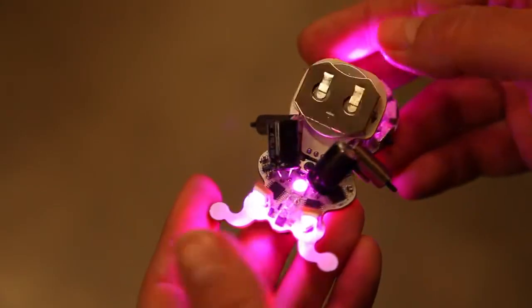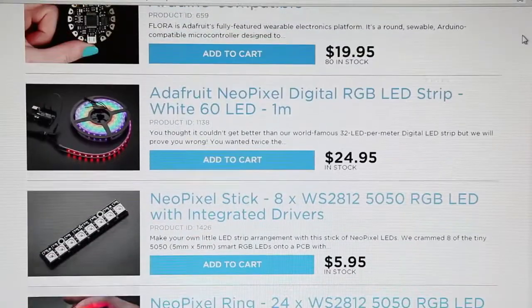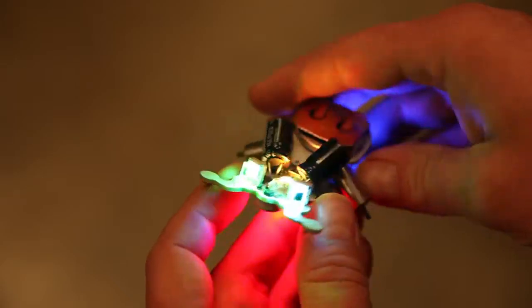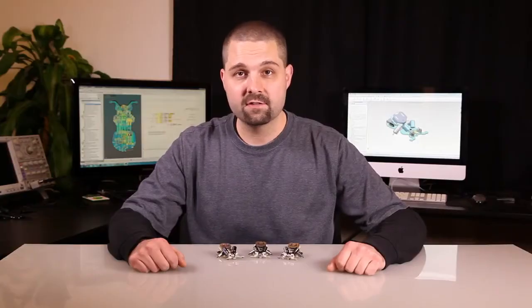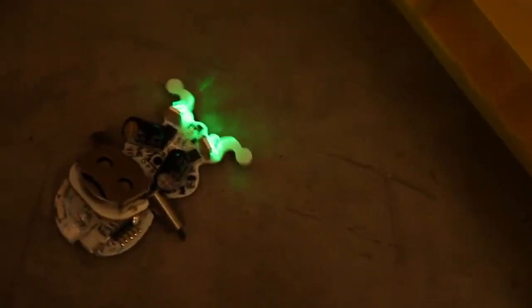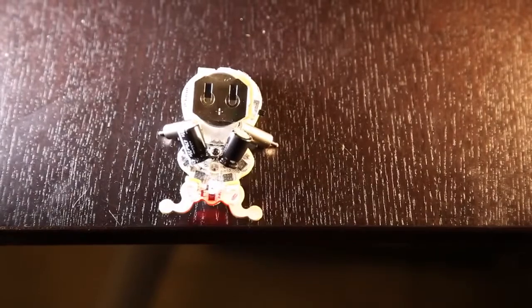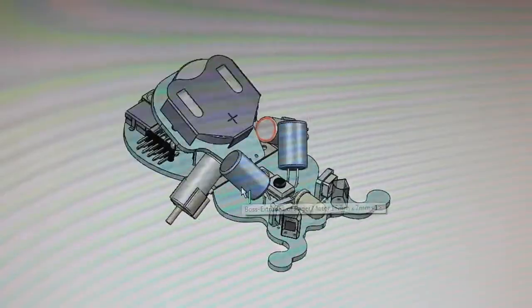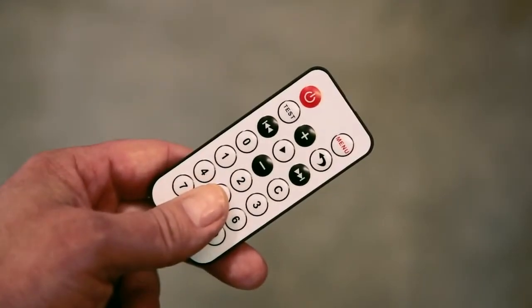He can show you how he's feeling with 6 RGB LEDs. These are the same lights used in NeoPixel products from Adafruit. Each can be made to show any color you can think of, and they can be controlled individually. Ringo can see light from 360 degrees using 3 sensors. He can determine the direction of light and shadows. There's sensors under the feelers that can be used to follow a line, sense edges, and avoid jumping off your table. Thanks to an onboard TV remote control receiver, you can trigger and control behaviors with the remote or teach him to respond to just about any other TV remote.